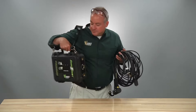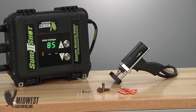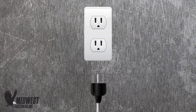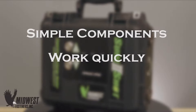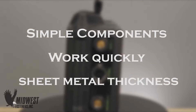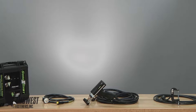Setting up for stud welding is a simple process. Weld studs, sometimes called stud welded fasteners, can be welded using capacitor discharge stud welding, or CD for short. This is a portable welding process which uses readily available electric power from an everyday 110-volt power outlet. CD welding systems have simple components, work quickly, and can be used on sheet metal thickness material to apply studs and a variety of welded fasteners using the capacitor discharge process, offering a high strength weld both quickly and reliably.